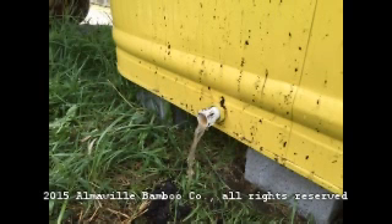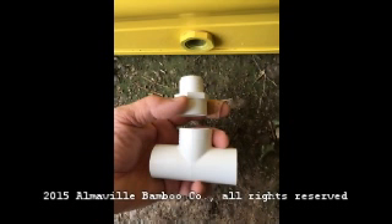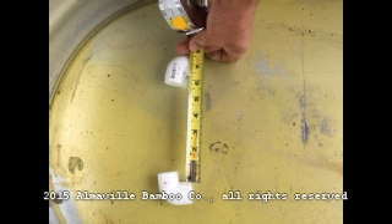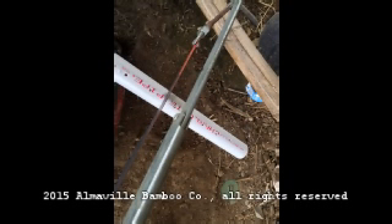This is after all the plant material and dirt was in place and we had watered it in. If you had two or three or four of these together, you'd simply join the plumbing together with glue fittings on the PVC and T intersections. What you're looking at here are holes drilled in schedule 40 PVC, just as you would for drainage. Make sure you get all your measurements accurate — start with the base of the unit, then put all your junctions together and measure them accurately. Measure each one individually in between so you know what length to cut the piece, mark it with a pencil, and then cut it off with a hacksaw.